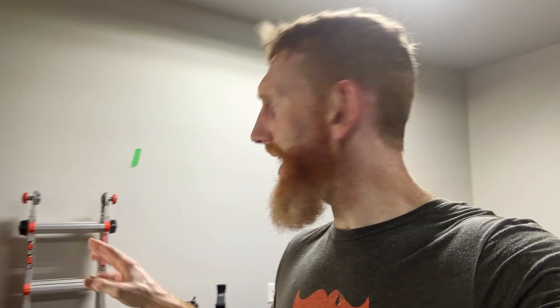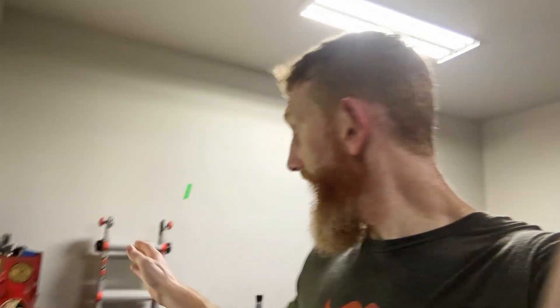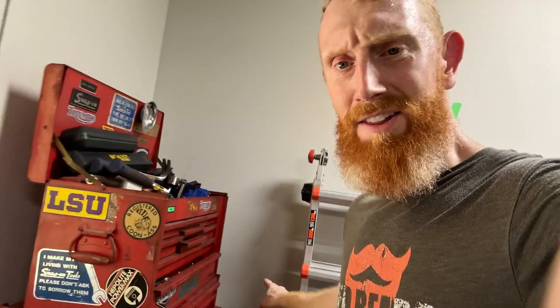We have the wire pulled down to the panel. I'm going to run it all the way across the attic, and on this side I'm going to drop down into a wall and come out of the building. My inside air handler is going to be where that green dot is, and I'll put the disconnect box offset to the unit outside — you don't want it installed directly behind your unit since it makes it hard to get to in an emergency. I got lucky because there's an existing outlet with a pre-drilled hole in the top plate I can snake my wire through, saving me from drilling another hole.